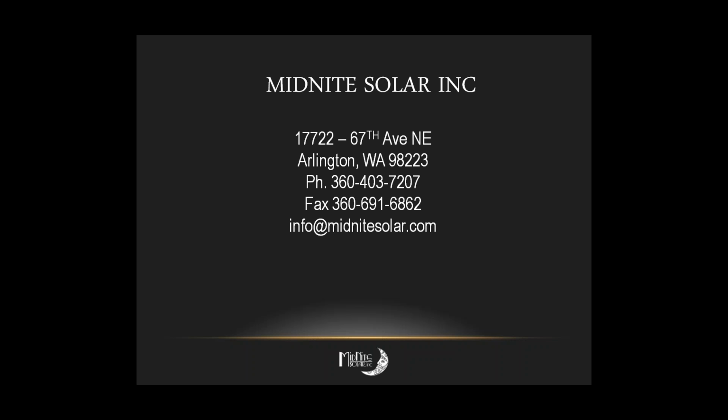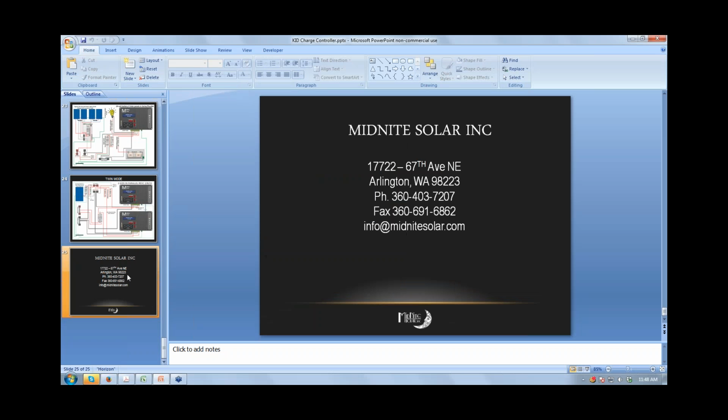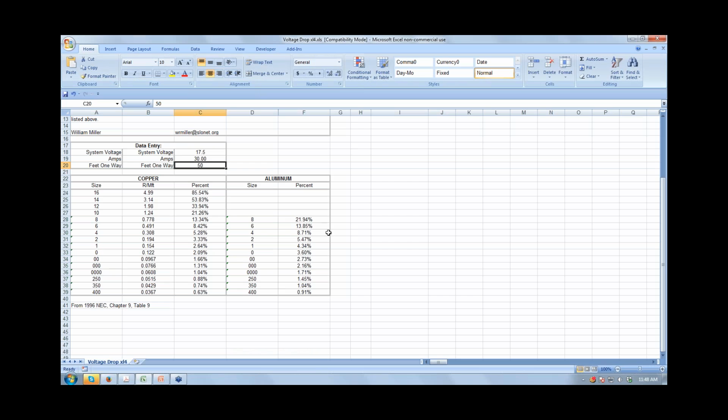It varies anywhere from 200 to 1,000 feet. Usually if we're going like 1,000 feet, we're maybe using 10 gauge instead of 12. Wow, that's a heck of a wire run. Yeah. All right, I'm going to back this off and open up something here.